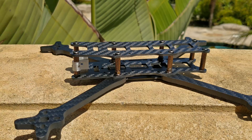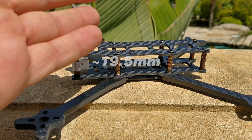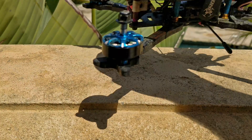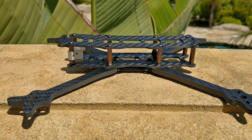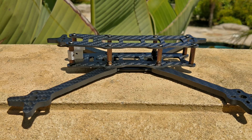It does have a very low top plate — not very low by today's standards, but very low by old-time standards. The original Alien has 36-millimeter standoffs, so much higher than this 20-millimeter build height. Actually it's a 20.5-millimeter build height because the center standoffs are a little bit lower, so the battery sits relatively low. I recommend a 2207 or a 2208 motor on this frame — I do not recommend 2306, even though that's what I'm mainly flying now. The 2207 motors are actually great. I've been talking to GetFPV about the Johnny Shread 2207 motors — the price is a little extreme, but it's a really impressive motor.